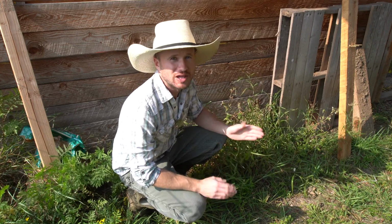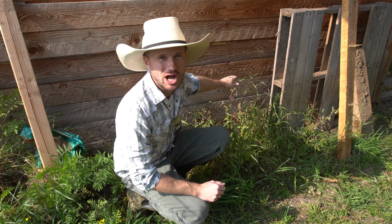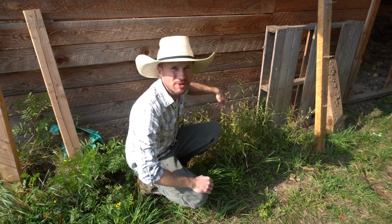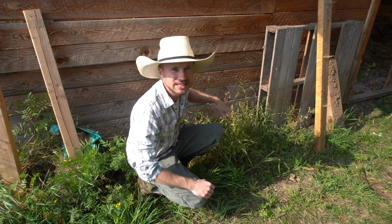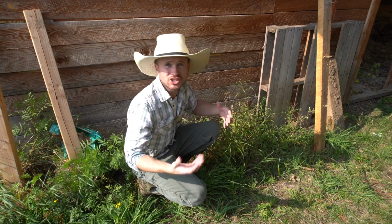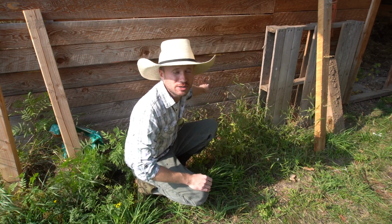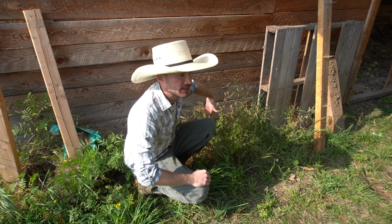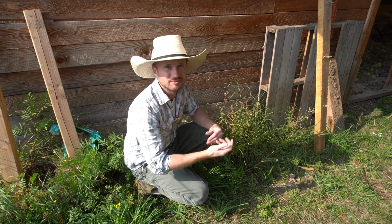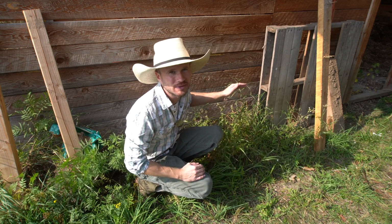If you guys have been following the videos, you know that I'm working on getting the floor in the outbuilding cemented. I need to put a sweep in there. I need to daylight in some conduit, so that later next year or whenever down the road I have the utilities put in, electric and water, there's piping already in there going up through the floor into the cement, because we're not going to be able to easily do that later after we pour the concrete.